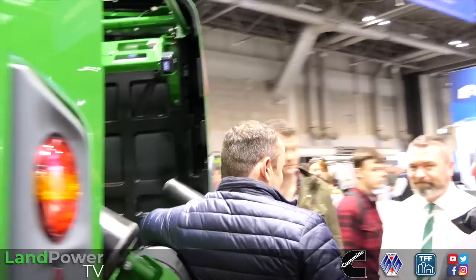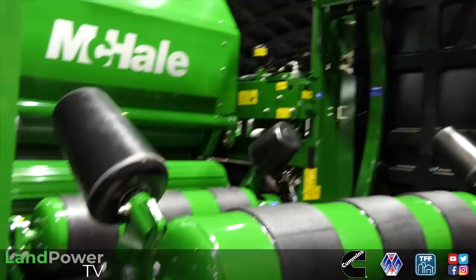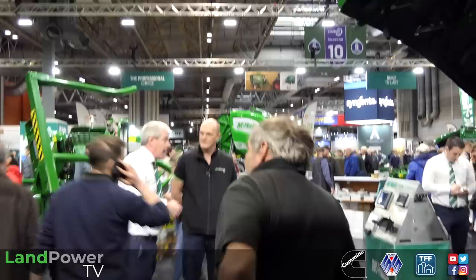On the Fusion 4, with the heavier shafts on the rollers, inside they've gone to a 55mm shaft. Also depending on the tractor, if it can read PTO speed in the Isobus, it'll automatically drop the floor down if you want. How it actually works: there's a sensor on the roller in the chamber, and if it sees the roller not rotating, it automatically knows it's blocked, so it drops the floor down. Do you get a warning? It'll beep - or you'll hear the PTO clutch going off.